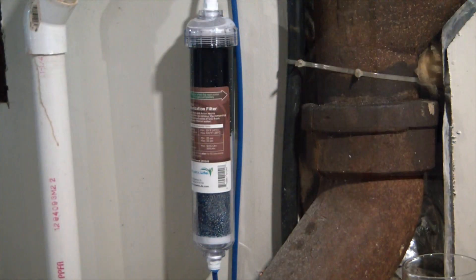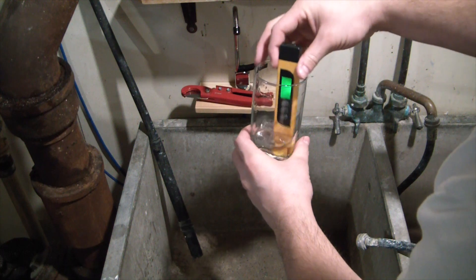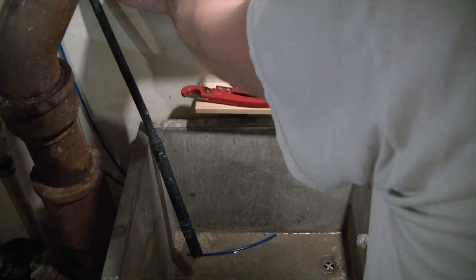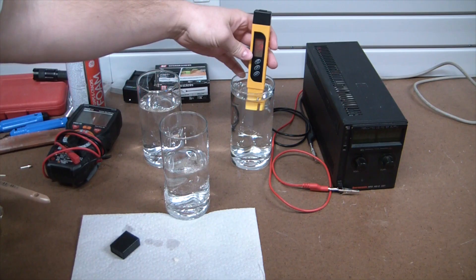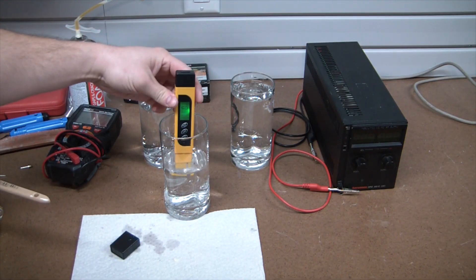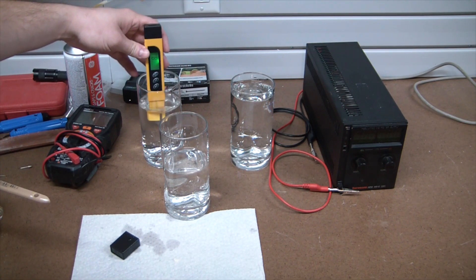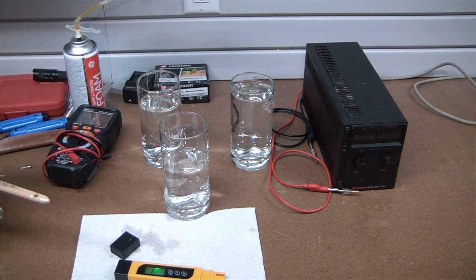That's pretty sweet though. Nice — we are at zero, another zero, we've got some super pure water guys. That's a lot of work just to have clean glassware! Alright guys, so we have taken our crappy tap water at over 400 ppm down to — let me clear it — this is our DI water at zero. Pretty freaking awesome. Just for reference, this is the RO water coming out at 9, so very very effective method of taking the TDS out of water.